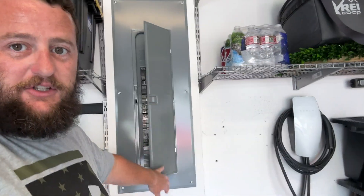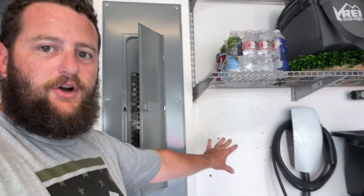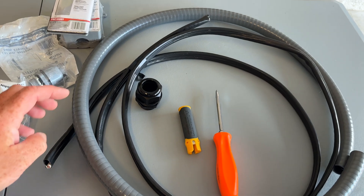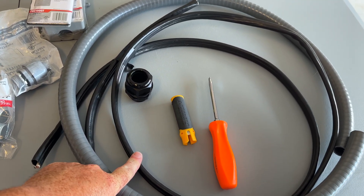With this newer home, I have tons of room available in the panel. All of my breakers are Square D, so I've already gone to the hardware store and picked up a new two-pole breaker that we're going to be using for this. I've also moved the charger over a bit so there's plenty of room for both chargers to be stacked here for convenience. For this install, I did get some 6/2 wire, and I'll explain why that size later.